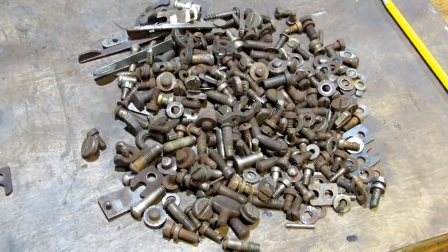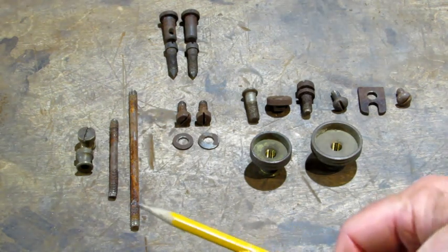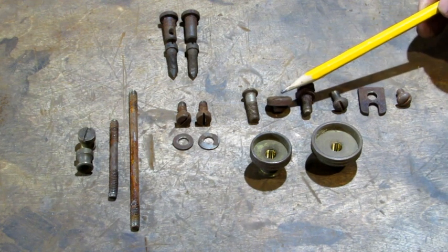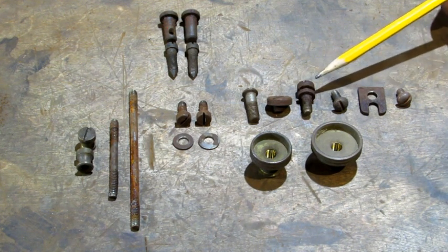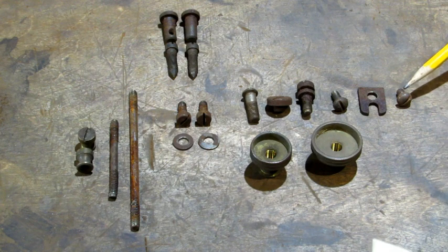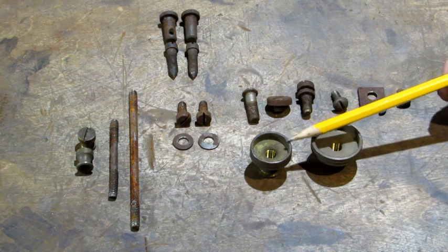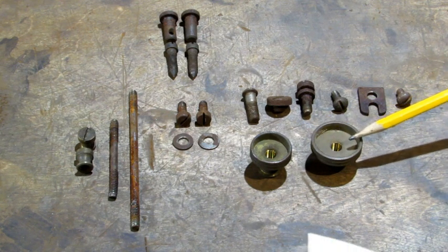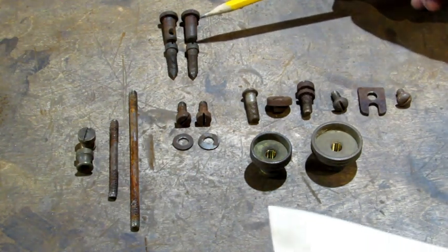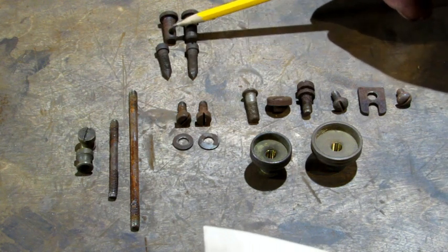I dug into my small parts pile to find examples of everything. Here's a breakdown of the parts I'm going to be working on: first up are the tote, knob, nuts and bolts. Here I've got the lever cap screw, the plane iron screw, the frog adjustment screw, the plane tote screw, the frog plate, the frog plate screw, and the depth adjustment nut. Stanley made, in the older planes, a small nut and a larger brass depth adjustment nut. Up here on top are parts unique to the Bedrock series of planes — it uses frog screws that go into the frog pins to hold the frog in place.